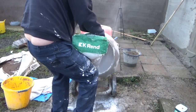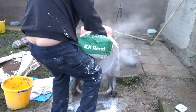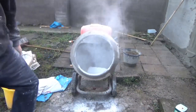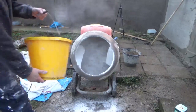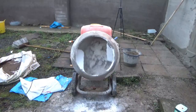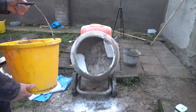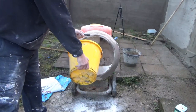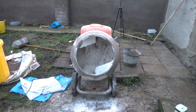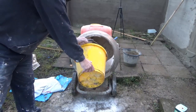Nine times out of ten I'm doing these renders with a two-coat pass followed by a close-in or a wet bit over the top, and that'll all be scratched off after. After your first mix and you get the consistency you want, if you're doing anything big you should keep note of how much water per bag you used. It's all about consistency.